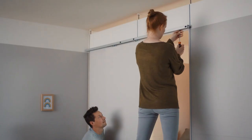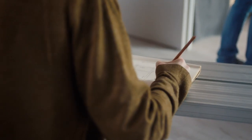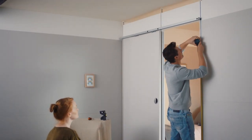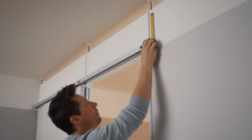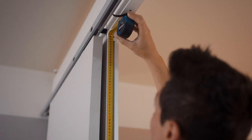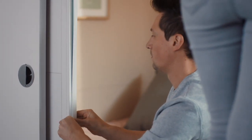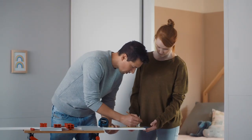At this point you can adjust the stopping position of the door to prevent it opening too far by screwing the rail stopper at the appropriate position. It is now time to cut and fit the vanity strips for the three posts the sliding door rail attaches to. Measure the height of the grooves below and above the door rail and cut the vanity strips to size. Do the same for the gap below the sliding door panel on both sides, then push them into place.